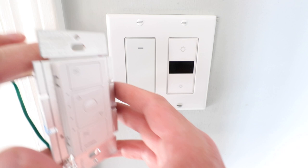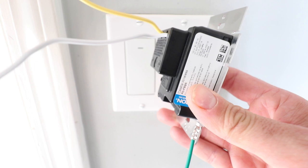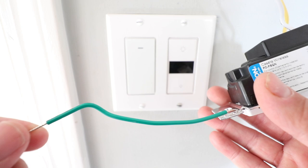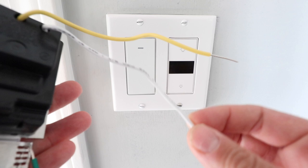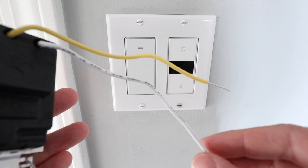So we're going to go ahead and install this smart fan dimmer. A couple of things to note before you install this smart fan controller: on the back you've got a load wire here going up to the fan — that's the yellow wire — and you've got a neutral wire on the back in white. These do require a neutral wire for installation, and then you've got a ground wire with the green. On the side here is the incoming power, the hot terminal. So before you install this, you will need to determine if you've got a neutral wire in that fan switch box.